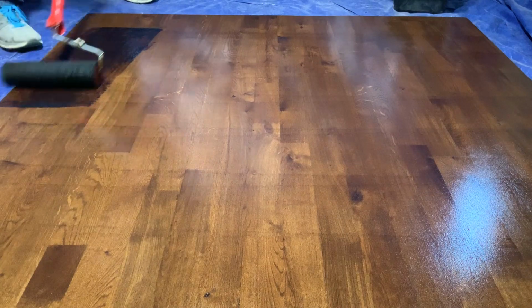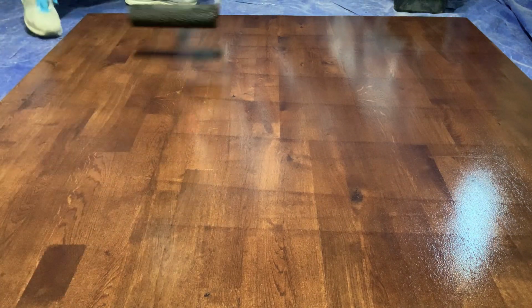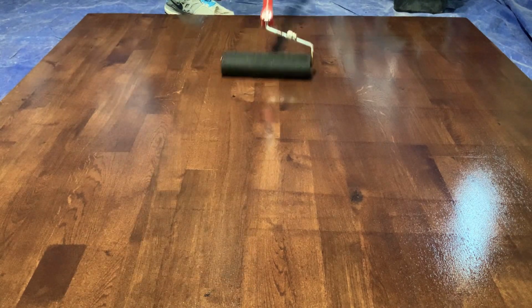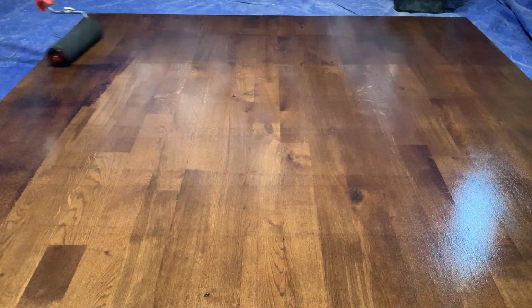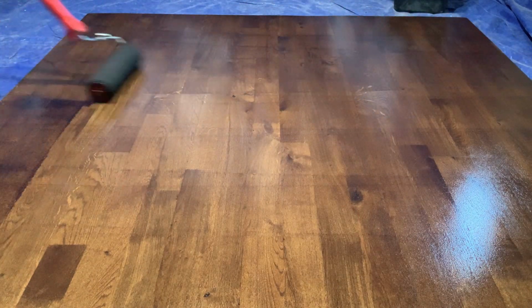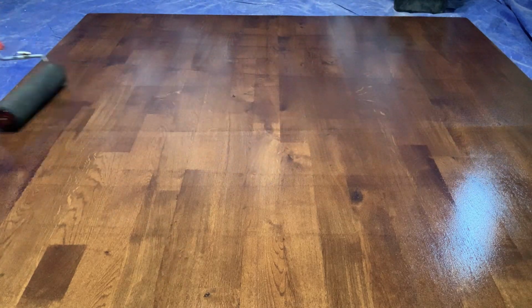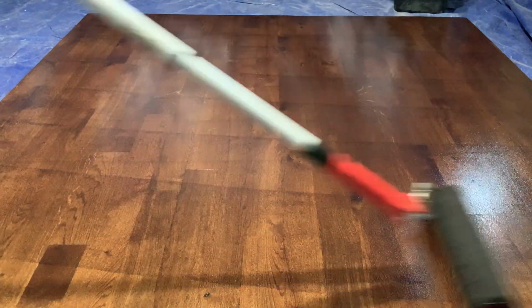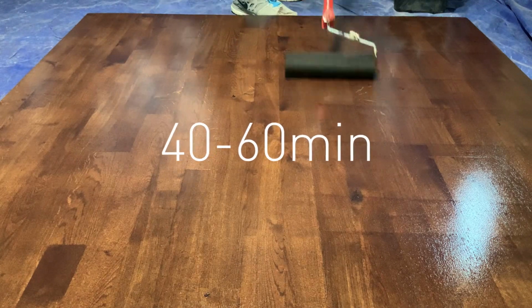When using lighter pigment in products like Nordic and Grey, these can quite easily be rolled out to achieve a perfect finish. With white and cocoa brown, the finish is easily achievable, but you will be required to roll out just a little bit more to ensure the finish is even. If your room is very large, we would suggest working to a point along the width down the whole length of the room.